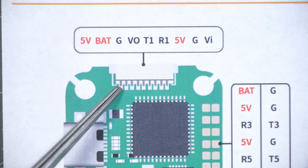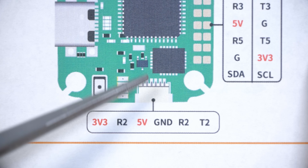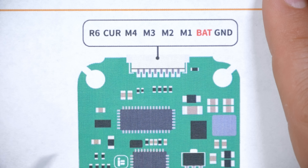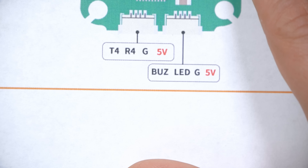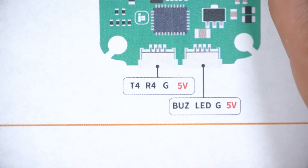On one side of the board there's a plug intended for the camera and video transmitter. On the other side there's a plug used in the bind-and-fly version for the receiver — it has UART 2 as well as 5V and 3.3V, and for some reason it has R2 in there twice. iFlight does that on all their flight controllers. On the bottom there's a plug for the ESC and a plug for additional peripherals like GPS and LEDs. This flight controller is great — it has pretty much all the capabilities and expandability anybody could ask for.